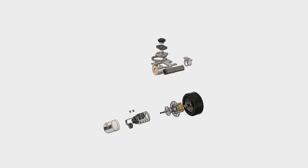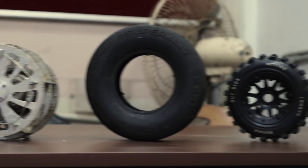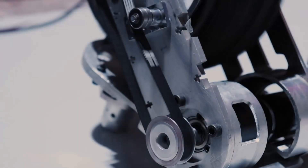After experimenting with several types of wheels, we have narrowed down on terrain tires. These offer the resilience of balloon tires and the traction of rubber tires. Transmitting the power through a belt drive isolates the motors from impulsive loads without loss in efficiency.